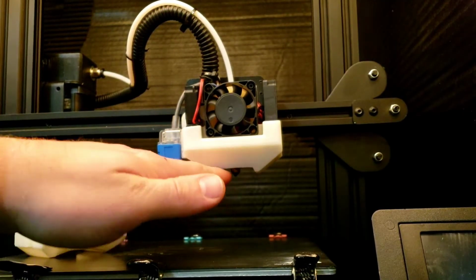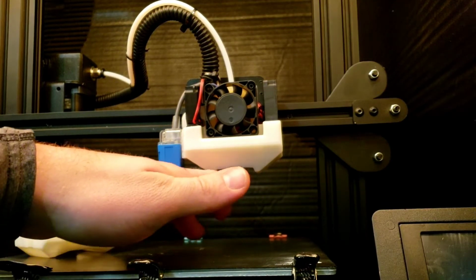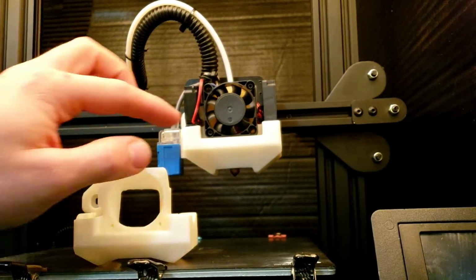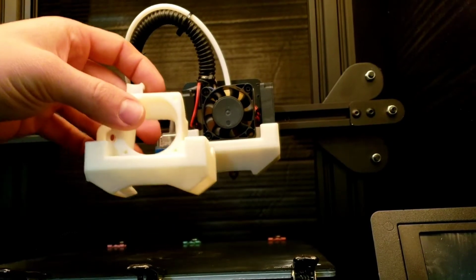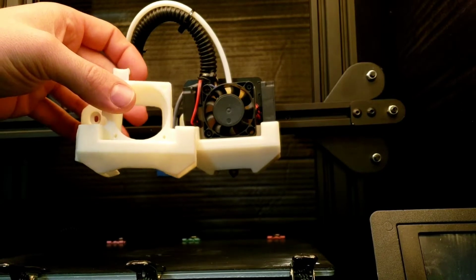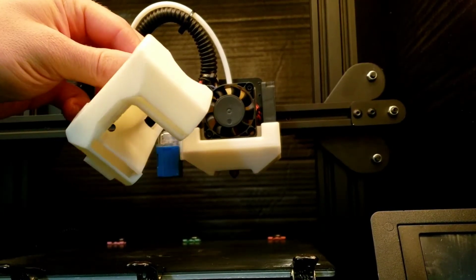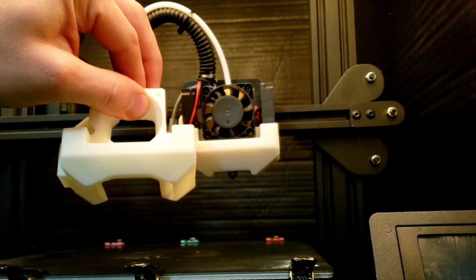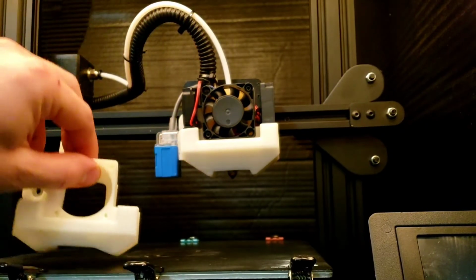And the only issue I was having was the vents down here. We're hitting the nozzle and cooling the nozzle and clogging stuff up. So to fix that and to give us a little more view room of actually what's going on down there, you see the difference. We're up higher, shortened it, and I do have these giant vents for now, but they're at a different angle, going more down.